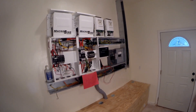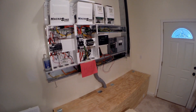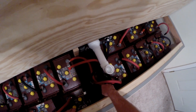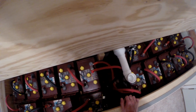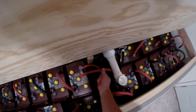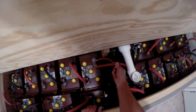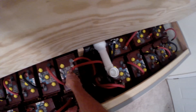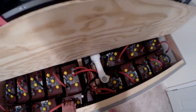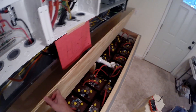Okay, today's the big day — we're going to start throwing some switches and see what works and what doesn't. On my battery bank, I have a bank here and a bank here, connected in parallel with connection wires — 48 volts for the entire bank. I've got two hot wires and two ground wires going up to the main panel; they're number four wire, and the positives are on 200-amp fuses. We've got our fan running and about 50 volts in this bank right now.